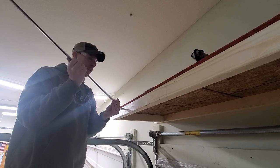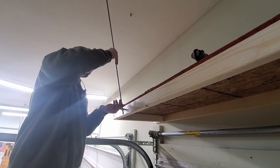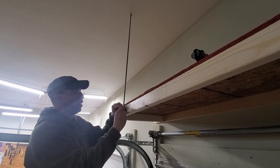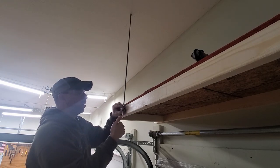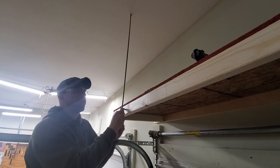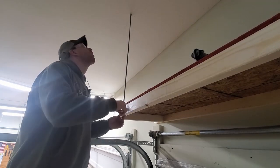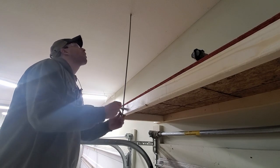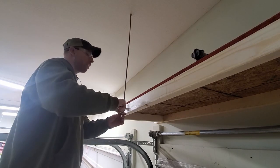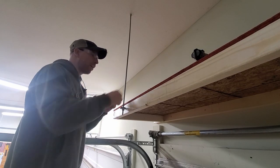The pattern I'm using here is: nut on top, then reinforce with a flat washer and fender washer, go down through the eye bolt, then fender washer, flat washer, and another nut on the bottom. This allows me to adjust the level and capture everything together in one big threaded sandwich. I'm just going to make sure it's seated well up into the upper anchor.